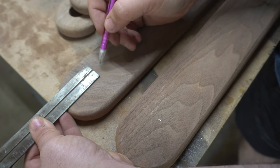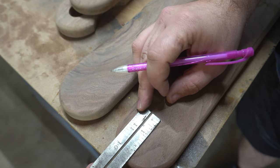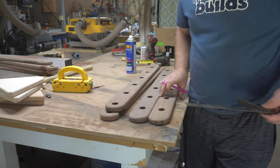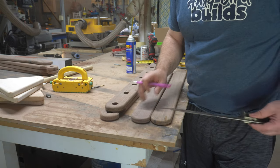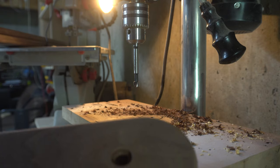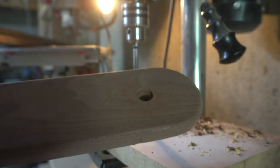The placement of the pivot point hole was a little tricky — this is where the bolt from the knob goes through to enable the pickler to fold up. But to my surprise, this part actually went fairly smoothly. Once I figured out the measurements for the first one, it was a matter of repeating it on the next five. I also took these measurements back into Fusion and added them to the model so next time the CNC will pre-drill these holes. All the files I'm offering have been revised to work out all the kinks, so the issues I ran into, you won't.